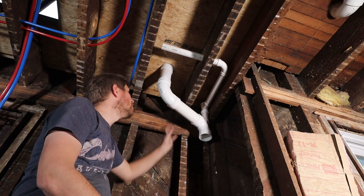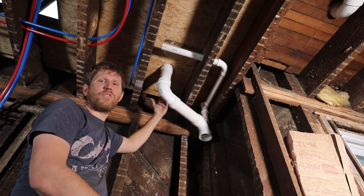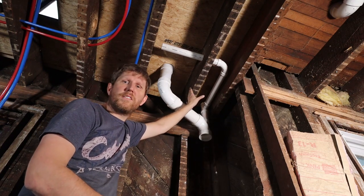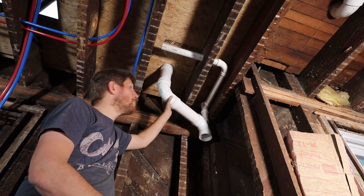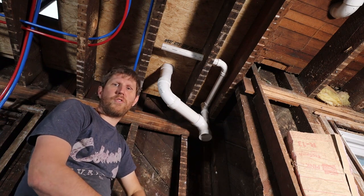And then this, unfortunately, the toilet has to go this way because I cannot notch the stud out enough to hide the toilet drain pipe, so therefore I will have to go a small little header down here to in the corner.